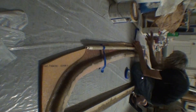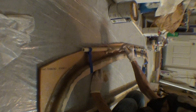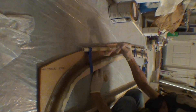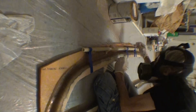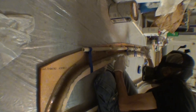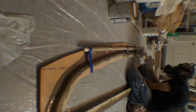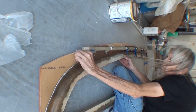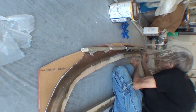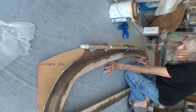I'm doing a lot of sanding, and now I'm going to glue the hinge to the two parts. After taping those pieces of water pipe in place, I'm putting just a little bit of thickened resin at either end of each piece just to tack it in place. I'm not going to put any more fiberglass on it right now — I want to let it harden and then come back, remove the tape, and test if I've got a working hinge.